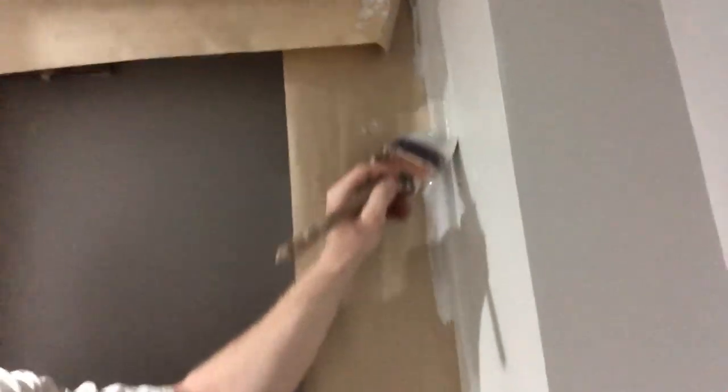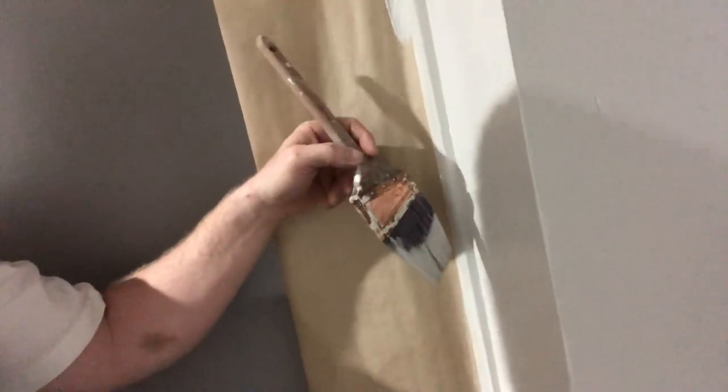When you see every 24 inches or so a color differential, that's caused by the brush and the changing of direction. Now if your painter took the time to give you a very professional finish and gave you two coats, you won't see that. Here's how you would paint that — let's say I'm painting back and forth all the way down to here and I still have all that way to go.